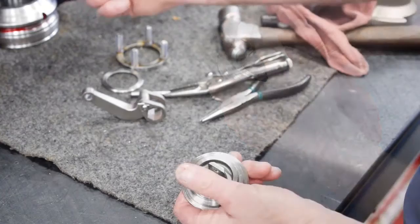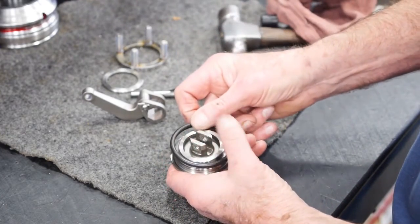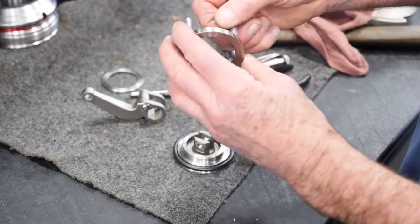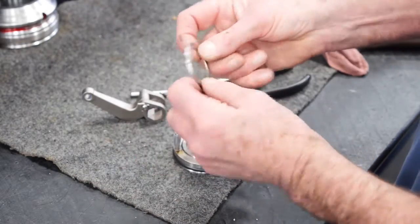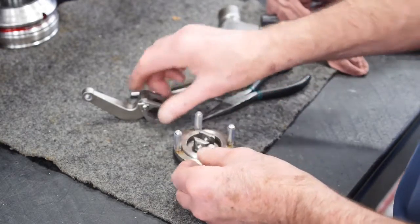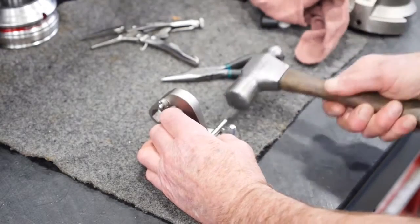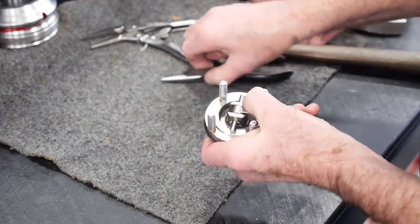Now install the new o-ring. Pass the o-ring over the back of the poppet linkage sub-assembly to the back side of the poppet. Install the retaining ring into the groove in the poppet, behind the poppet guide. Make sure the retaining ring slides into place with the flat side facing up. Reassemble the poppet guide onto its diameter in the coupler poppet, making sure the bearing is still in the poppet link. Using pliers, bend the cotter pin in place.